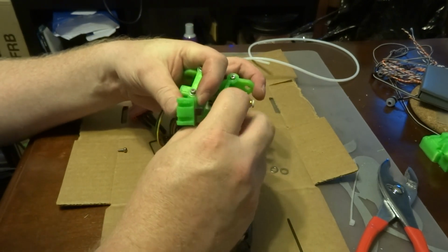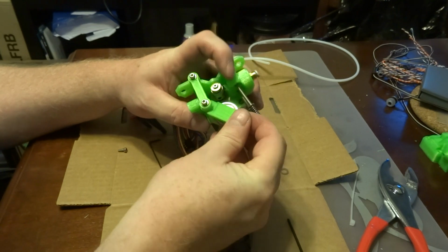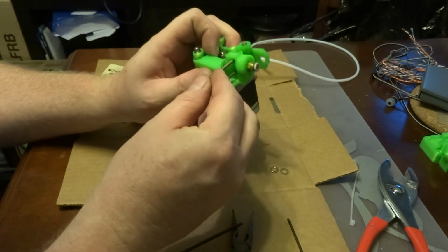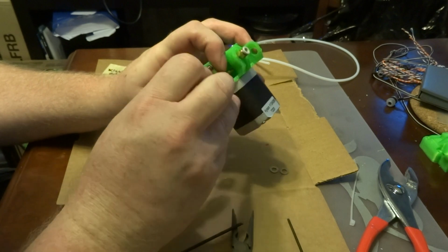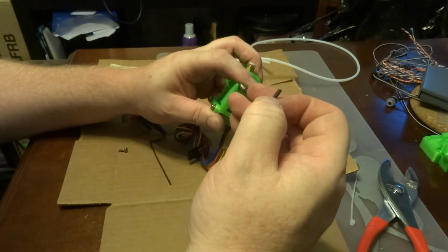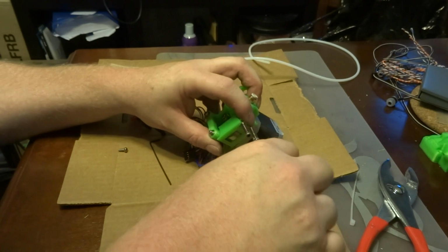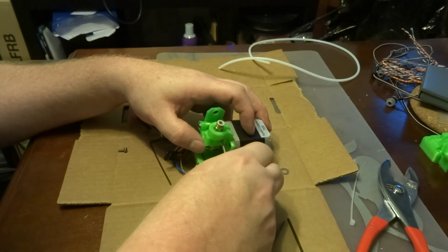and the way that you'll load filament is you'll push the filament through the bottom, through the gear, into the top, and then you get the hang of this. Pull the springs back and drop them into these little areas. And if you don't have enough grab with the washers on the end, if they slip up like this, then you can take these M4 washers and you can add a little bit of grip.